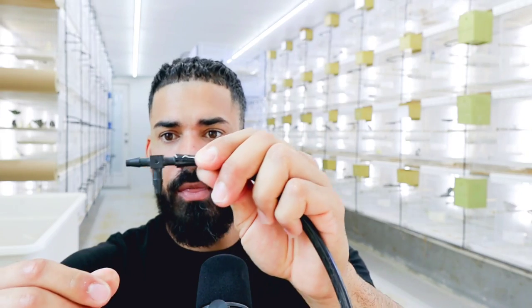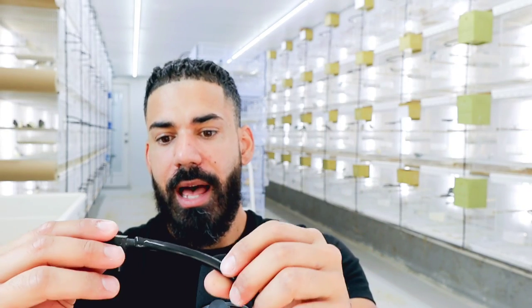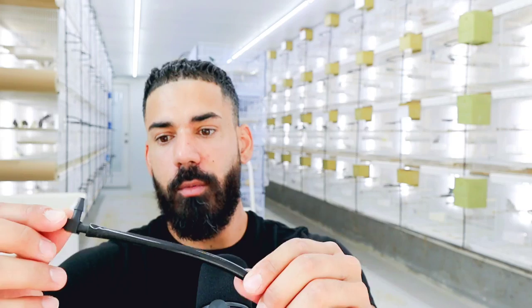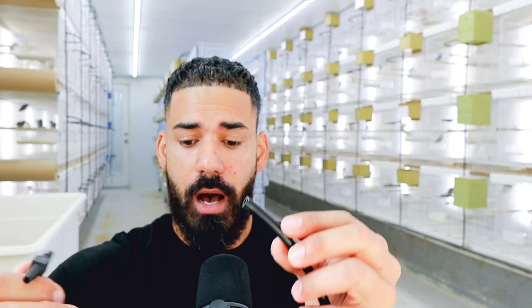Other problems I had were that these T's were difficult to get inside of this hose. Some of them go in about halfway fine, but then to push them all the way to the end is nearly impossible. After about a week of pushing these things in, I could barely feel my fingers — it hurts so much to get these installed. So what I ended up having to do — since I wasn't going to go out and buy more T's because these already came with the system — was grab a lighter. I would heat up the hose just a tiny bit, not a lot. If you overdo it, you're going to mess up the hose. You heat the hose to where that rubber gets soft and then the T just slides right in without any issues whatsoever.